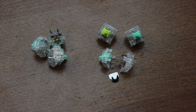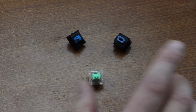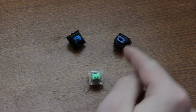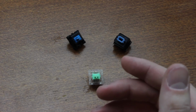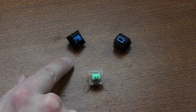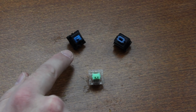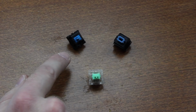This time we're looking at ZealPC's new Clickiez switches. This is one of the most exciting developments I've come across in a long time. They're basically a crossover hybrid between Cherry MX and Alps SKCM switches, which theoretically allows one to get a taste for the feel of Alps switches, synesthesia intended, while maintaining the compatibility options, plate mount, keycaps, etc., of Cherry MX, plus hopefully their resistance to dirt and dust as well, as Alps are famously sensitive to condition issues.